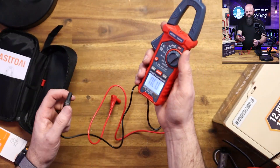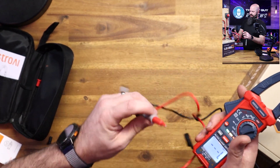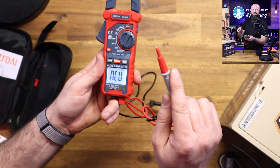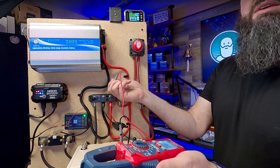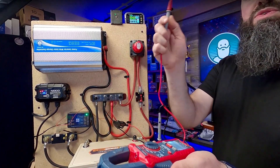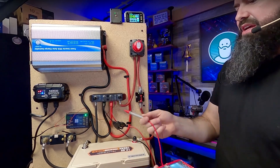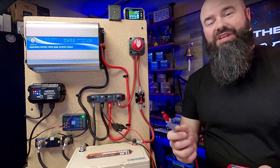When I go to Live mode and take the red input up to something — and again this is really reacting in the studio — if I take that red lead and touch it to something, it'll let me know that it's hot. So this is letting you know if you have live wires, just using the probe. You can bring it up and use the probe as a sensor to get into spaces you normally can't.